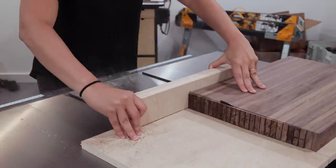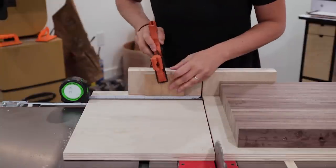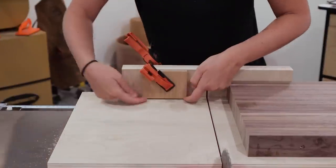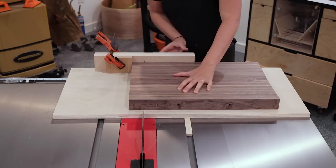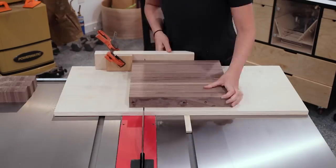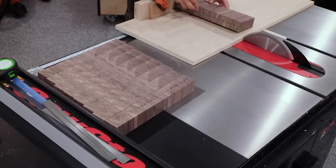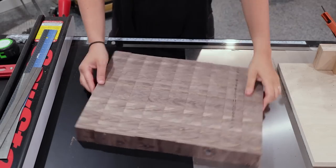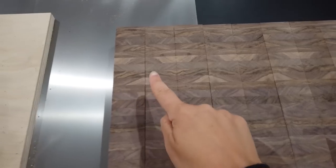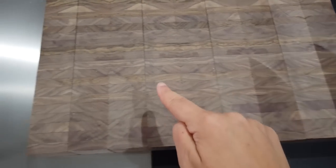Maiden voyage on the new temporary sled was a success. I squared up one edge of the board and set up a stop block at about two inches — lifted up off the base so sawdust has a place to go, ensuring all cuts will be exactly the same. This saw just plowed through the walnut; it is such a pleasure to use. I flipped over every other piece and the pattern was absolutely insane — like a natural-occurring chevron pattern. Totally worth the effort. I wish I had more pieces with sapwood because that's where the pattern really shined.